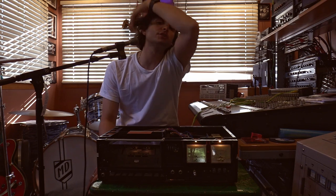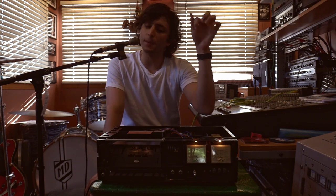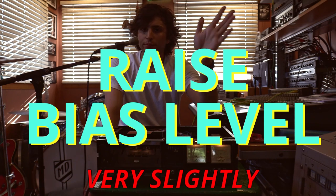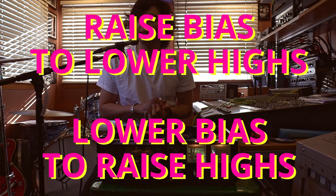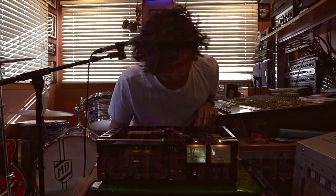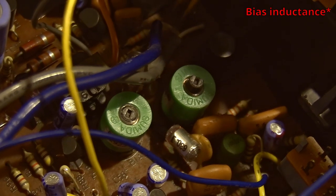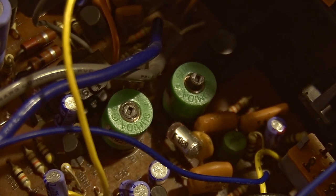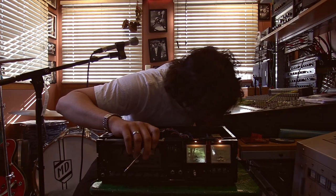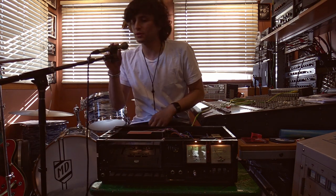So our higher frequencies are being recorded at a higher level than our lower frequencies. In order to combat this, we are going to raise the bias level very slightly and hope that takes care of the issue. I'm going to make a very small adjustment on the bias and do the same test again. Keep in mind when I make my adjustment on the bias level, I have no idea which direction is actually raising or lowering it — I'm just assuming clockwise is raising it. When I do my second test I'll see how both frequencies are responding, so I'll know whether I'm going in the right direction.